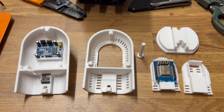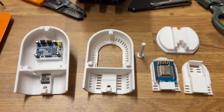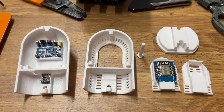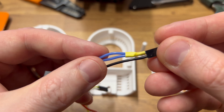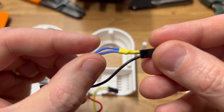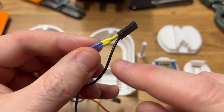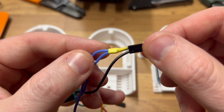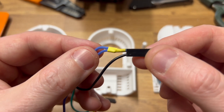The ESP boards and sensors connect together using female-to-female DuPont cables. The only slight niggle is that because you have two sensors that both have a ground cable and the ESP board only has one ground pin, you need to combine the two ground cables into one connection. So I just strip back the shielding from one cable and then wrap the terminal of the other around it and then protect it with a piece of heat shrink. So that's very easy.